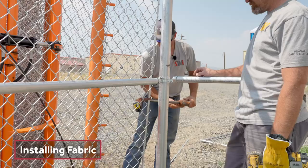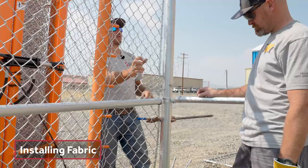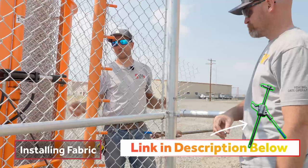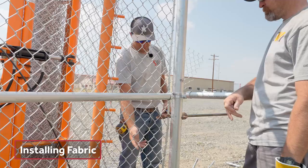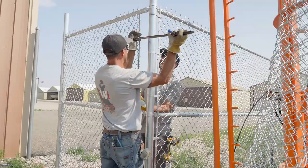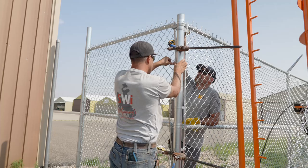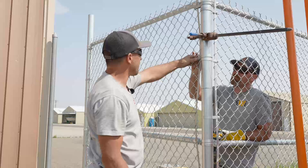This here is a pull jack. It's designed to put tension — pull tension on the chain link. Just another stretching device, but more so for shorter runs, or in this case scenario, we were meeting at the top but missing at the bottom. So instead of pulling the whole machine forward and bringing a whole bunch more slack up, it's easier just to do this. When you put these on, make sure you always pay attention to your top one because when you put your bottom one on, it likes to loosen the top one, and if you're not careful, this one will come down and hit you in the head.